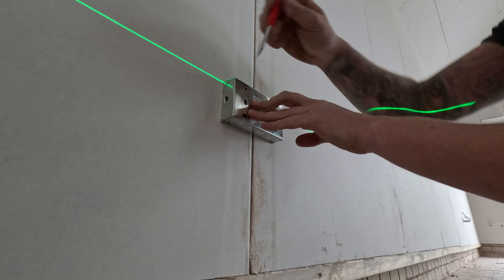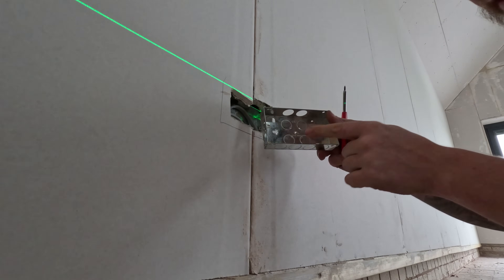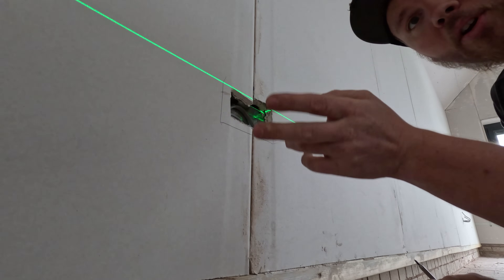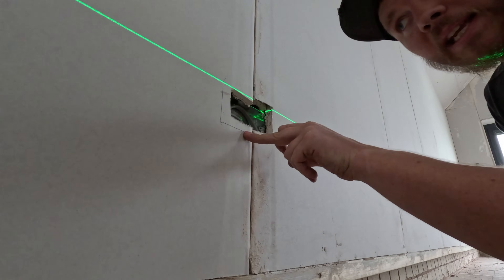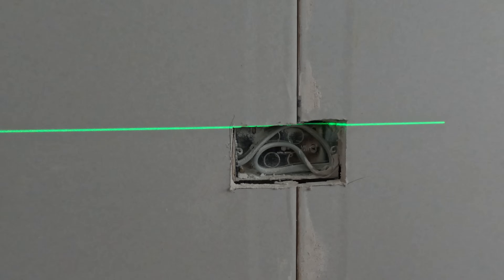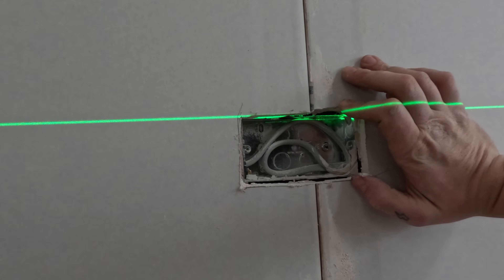I'm going to draw around this and get the multi-tool out, hit it flush because I want to be cutting with the multi-tool on the box itself. This one should be fine, no having to mess around. For the other ones when we start cutting out the excess, I've got some ply — we're going to cut that down, screw it on the inside. If it's too high we can piece back in the bottom, put some CT1 on it to fix it in place so when they skim it, it ain't going to move. As you can see, it's ten times better than it was.